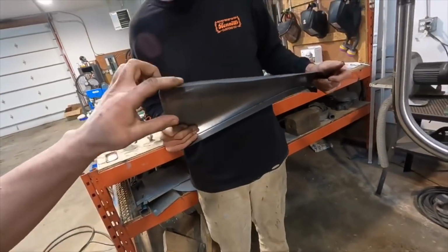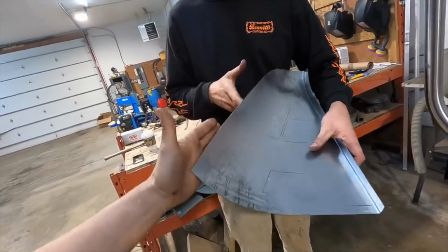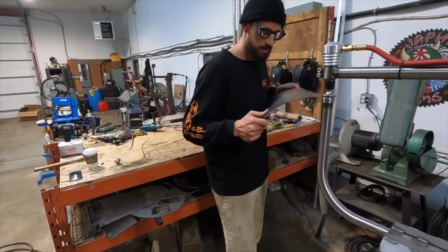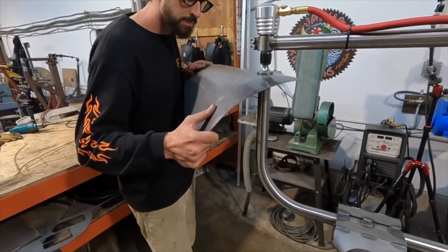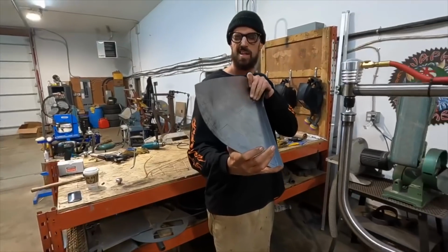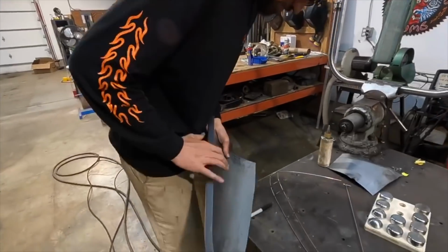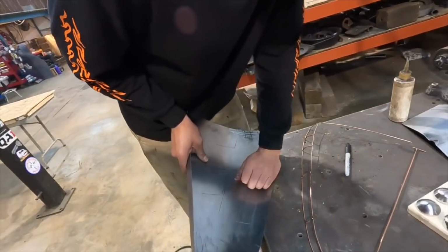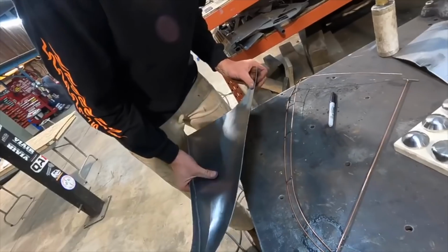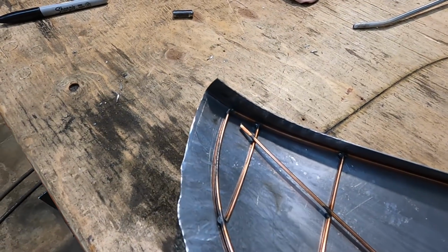Yep. And then this should be able to curve down a bit. I'd maybe just run it in the hammer and pull it so that this metal comes down a little bit, because that's what it's trying to do. Got a bit of a curve in her. I wonder if that's probably not from too much stretching, hey? Just that bit there. Yeah, I'd pull it down even more there, just arrange the panel a little bit.